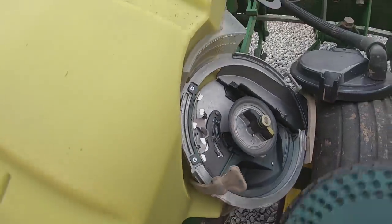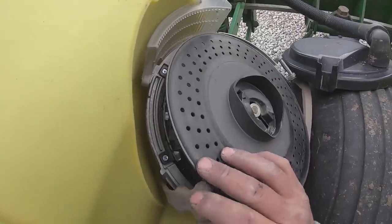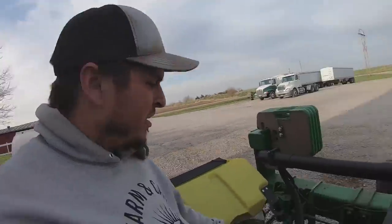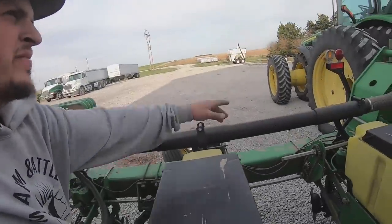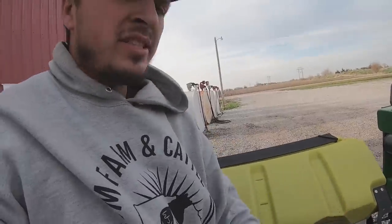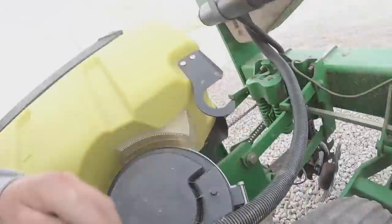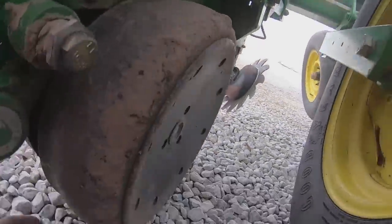Just like that, we'll take our plate, put it on there, then clamp it down. Then we got the vacuum cap and hose hooked back on. Basically this whole tube is a vacuum — it sucks the kernels in. Then this spins on the chain; most planters use hydraulic motors, and it runs off your speed — how fast you're going — which spins that and drops the seed right out of here, down through there and out.